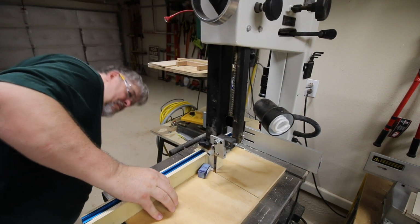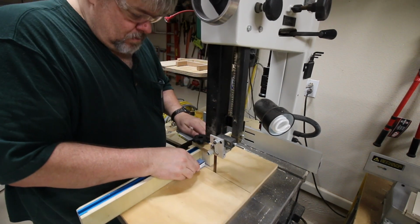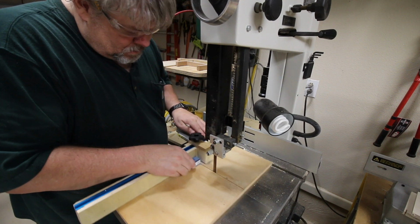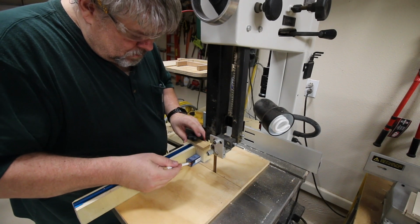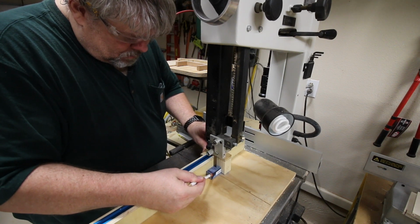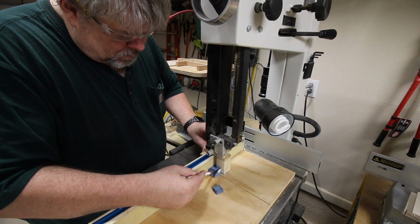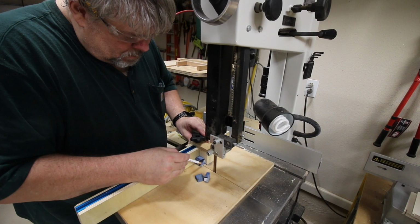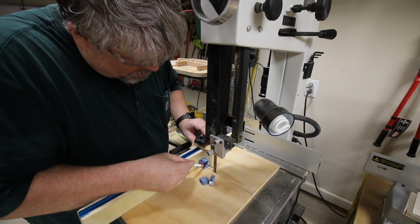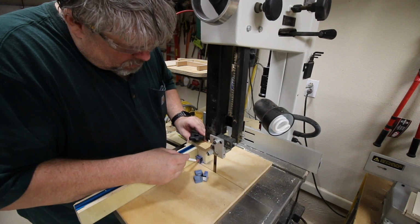During the making of today's blank, I'll be using my new bandsaw sled with the adjustable stop and the pen sizing jig. Right now, I've taken the piece of box elder that we have, and I'm truing up the end of it so I can try to pull 4 slices off of the blank. Each of these slices needs to be the same width. I just estimated how wide they could be here, and I got as lucky as could be. There was about a 64th of an inch extra on the final cut when I was doing this work.